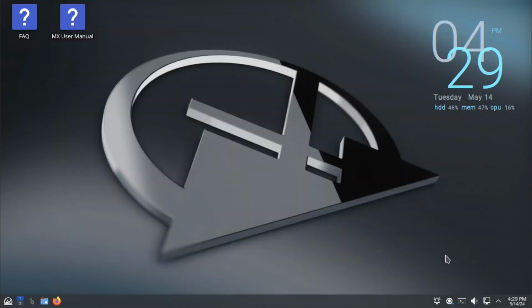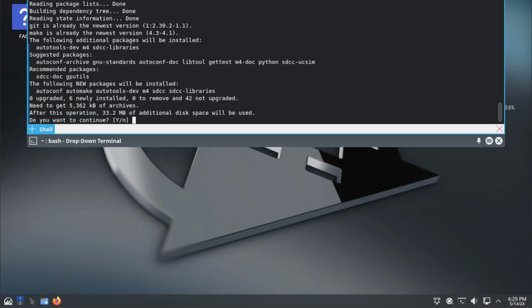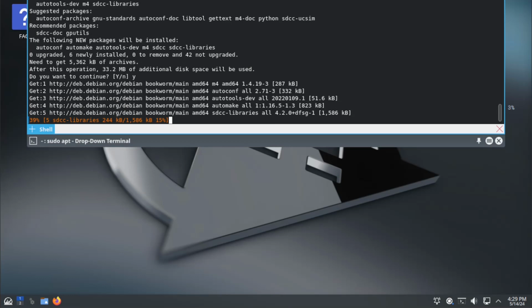So let me get out of here, go back here. To fix that, we have to actually download the firmware, build it ourselves, and then install it. So we're going to require some packages. So sudo, and again, I'll have all these in the description, sudo apt install. We're going to need git, we're going to need make, autoconf, if I can spell, automake, and sdcc. This may take a moment. If it takes too long, I'll go ahead and cut a part of the video out.